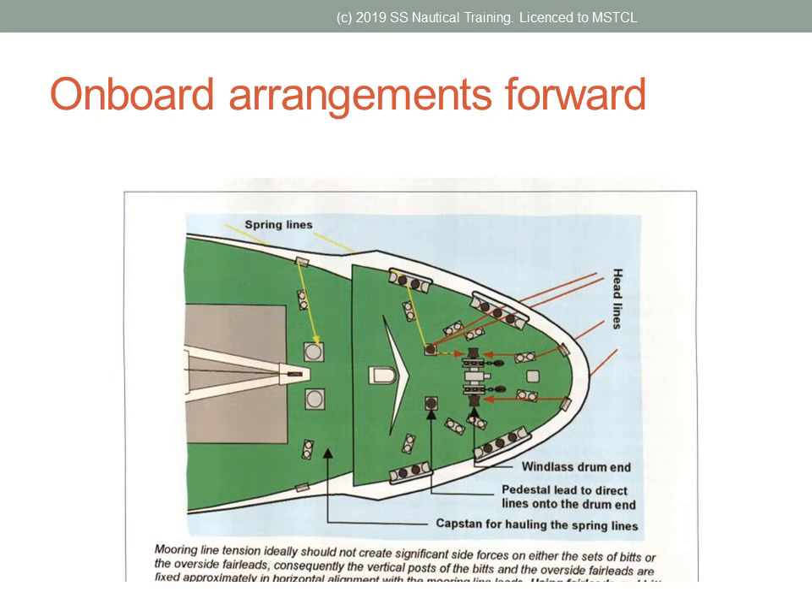The operation of mooring a vessel has traditionally required the attendance of a large number of deck crew fore and aft. Supervision of the moorings was also necessary to maintain correct tension through changes due to the tides and the loading or unloading of cargo. The installation of self-tension mooring winches, which maintain tension and ropes through any rise and fall, has removed the need for constant attendance, and equipment is available for tying up which is designed for operation by as few as two men.